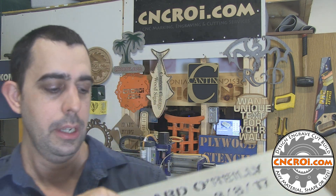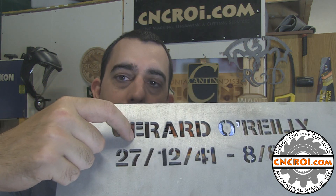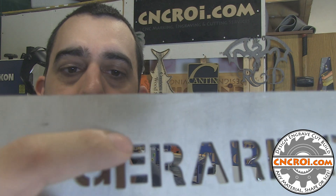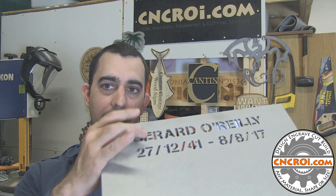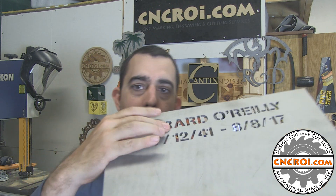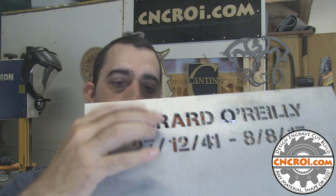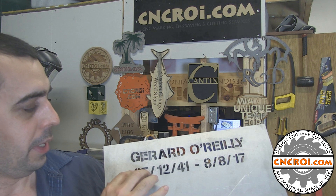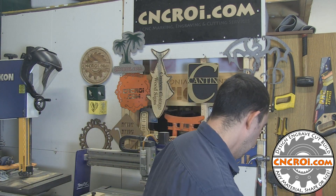My guess is that one of the slats happened to be exactly over the problem area. The water jet cut out this part of the E, and by cutting that out, the cutout didn't fall down into the bed like you want — it just stayed there. Probably a little surge of water came back up and hit the nozzle just enough to shift everything over, and when it did shift, that inside part finally fell down. All of this section is shifted, but because it's such a minor shift, I was looking at that plate forever and couldn't figure out what happened.